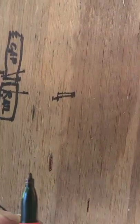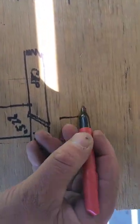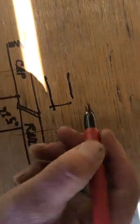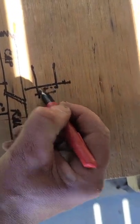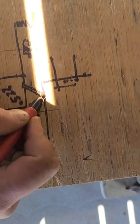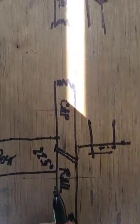It still gets me mostly a butt joint, right? It has the strength. If this is your material, it has the strength of a butt joint because you're running a fastener through that whole chunk of material. But it has the advantage of covering up that splice with an angle. It's just a shallower angle than a 45, for example. So I personally prefer a 22.5.